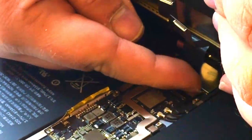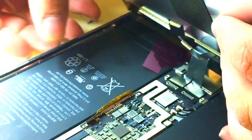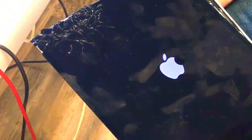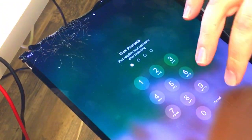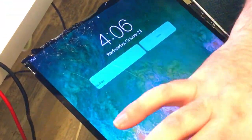We'll go ahead and connect the digitizer there and then the display cables. Now we'll release the battery, push that down, and we'll go ahead and turn it on. This is a cracked display — cracked glass — but it still works so we'll use it to test it. And as you can see I've got backlight on this device. Touch also works everywhere so I know that's good.